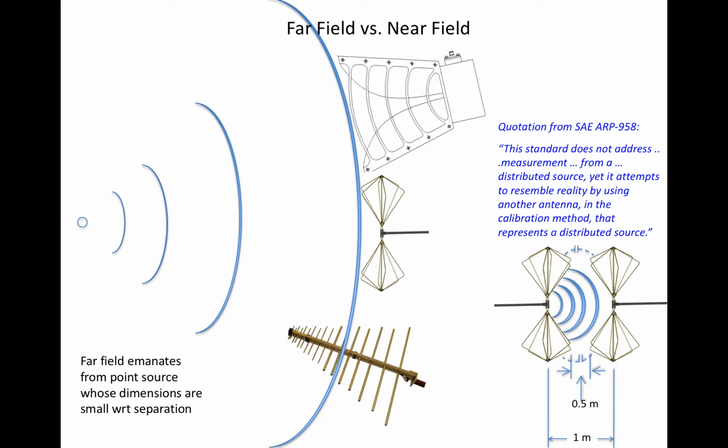Antennas calibrated in the near field are not interchangeable, and the calibration is only good for use at the actual calibration distance. This is because the calibration field is not plane, but has a wavefront unique to that antenna at that separation. When an antenna so calibrated is used to measure the field from a completely different source, say an EMI test setup in a shielded anechoic chamber, the resultant "field intensity" is relative to what the antenna picks up at 1 meter separation from an identical antenna.